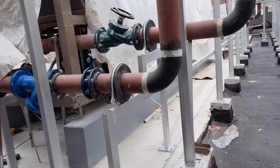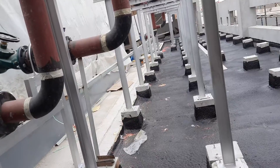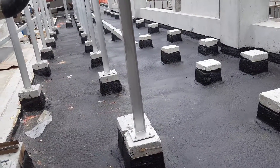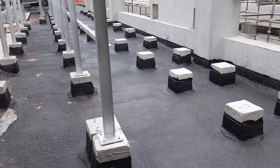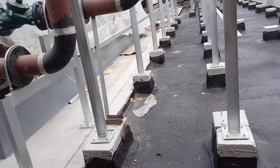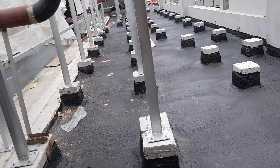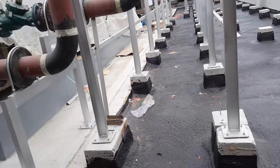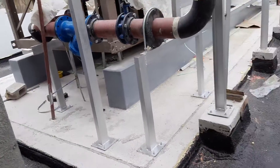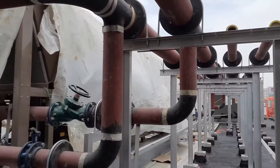We lifted the pieces on the roof floor. The waterproofing team is going to stop our work because the leak test is going to start this week. As you can see here, the black bitumen paint has been applied on the foam. If you saw my last two videos, the foam was yellow color — now after that they applied the bitumen paint, and they will fill water over here completely for the waterproofing test of the civil work.